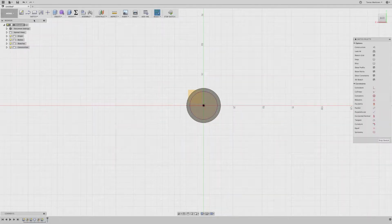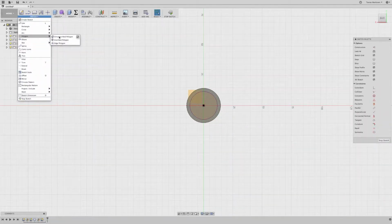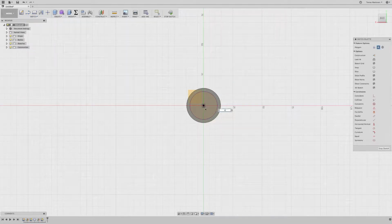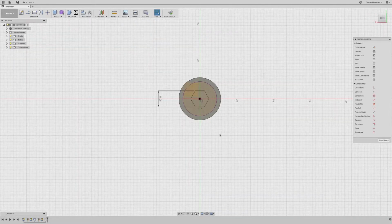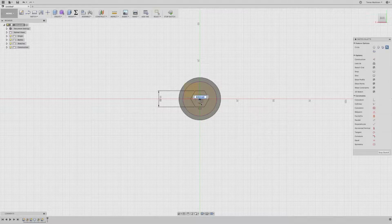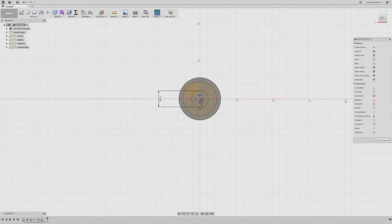Okay, then it's time to actually edit this sketch. I'm going to use the same plane. Let's make the hole for the bolt. Let's just make a polygon there. D for dimension. And this was 11. Let's add a constraint, horizontal, vertical. Now it's defined, it turned black. And then one more circle for 6.15. This is going to be for the bolt.